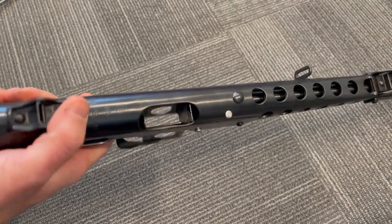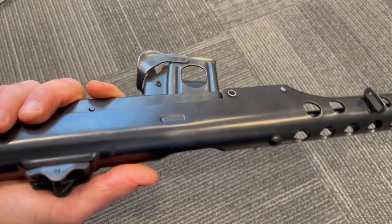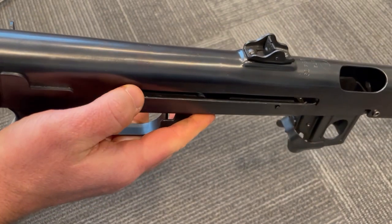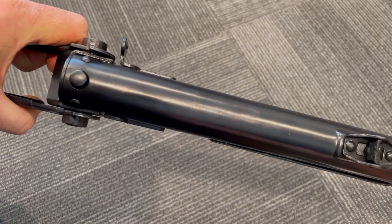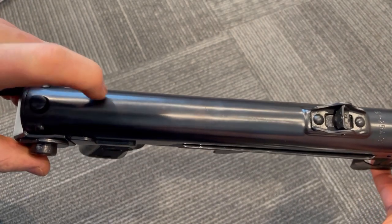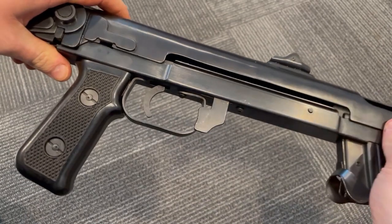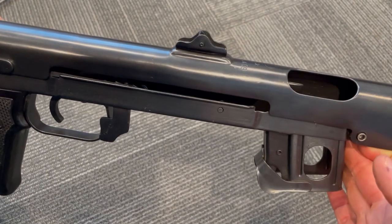For the flat sections here and at the back, your re-weld jig is round, so do the round welds and then clamp on a piece of flat aluminum stock on the back so you can weld the flats. Keep moving all the way back — there's another weld here. When you get to the back section, think carefully: you don't want to complete that weld until you get your denial bar in place. I drilled about five holes in the top where I actually welded my denial bar to the top of the receiver before finishing that final weld. The denial bar is welded into both pieces before finishing — otherwise you'd be building a full automatic, which is no good for the ATF.